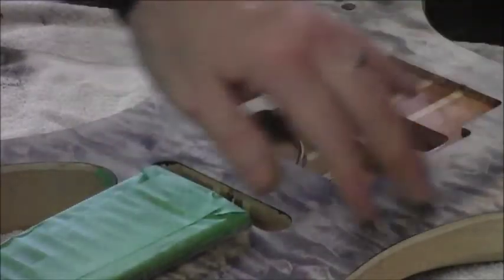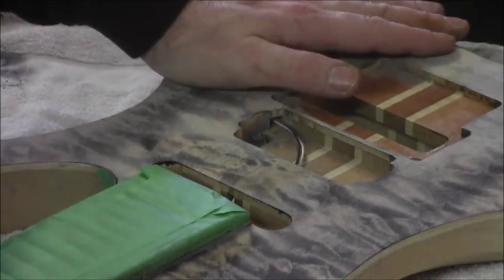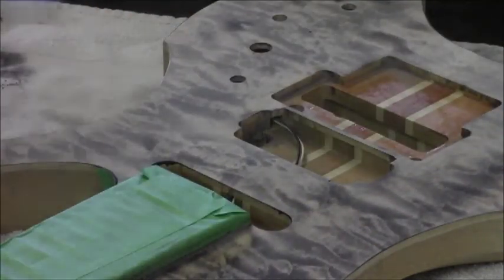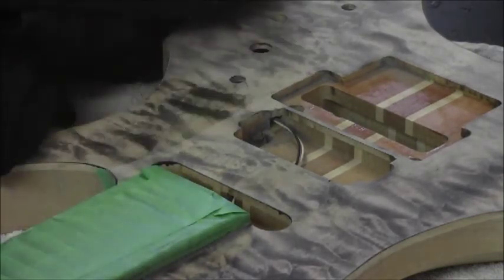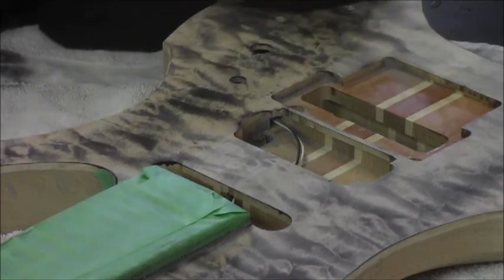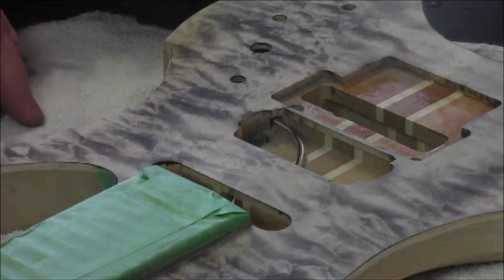You can see we've got a basic idea of what we're looking for here. When we hit this with a red stain and everything stains up red, there should be a pretty good contrast. The easiest way to see how much contrast you're going to have is to see how dark the black is when it's wet. And yeah, you can see there are some areas we've got to go back with a second coat — which isn't a big deal since we usually do two or three coats anyway. I've done the same to the headstock as well.